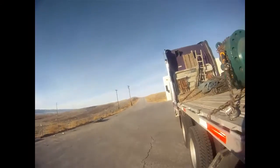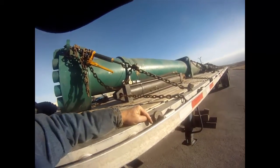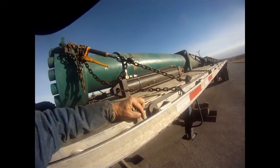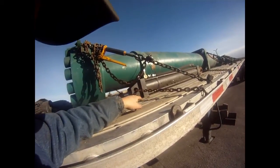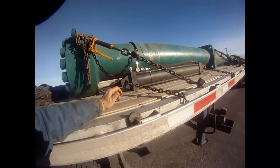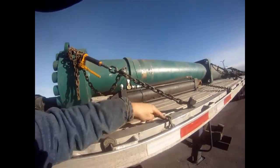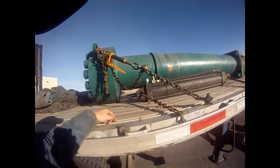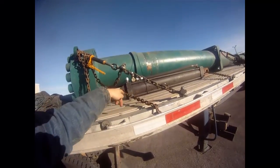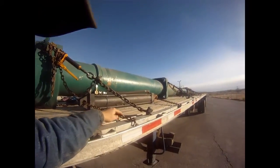So what you want to do, now I had to take the chain apart. You can take the little cotter key and straighten it out with a pair of needle nose pliers, pull the pin, feed it through, put it all back together. You know, carry some extra pins, I do. So I got it as straight as possible. And this is where I was showing the other day, I said, don't use just this, but you can use it in combination. This is what I wanted to do. I wanted to get as straight a draw as I could. So that's what I've got.